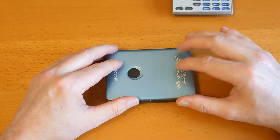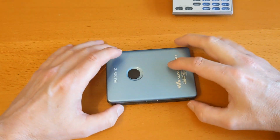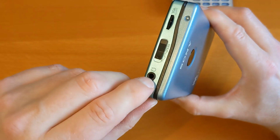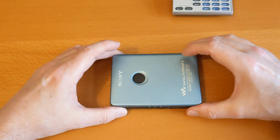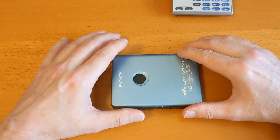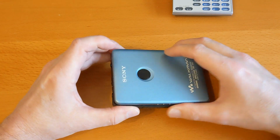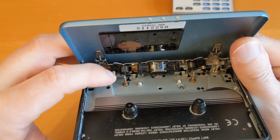I've got a couple of suppliers I really like for belts, and in the video I've already done for this, I changed the belts, I cleaned up the cassette head, I cleaned up the headphone jack because that was crackly, and the volume control because that was crackly. So I did all that, but I needed a pinch roller. So I shot the whole of the pinch roller video, really fiddly, lots of different shots while I was trying to get it right. And I haven't started editing that because when I played a tape in it, having changed the pinch roller, it still sounded awful.